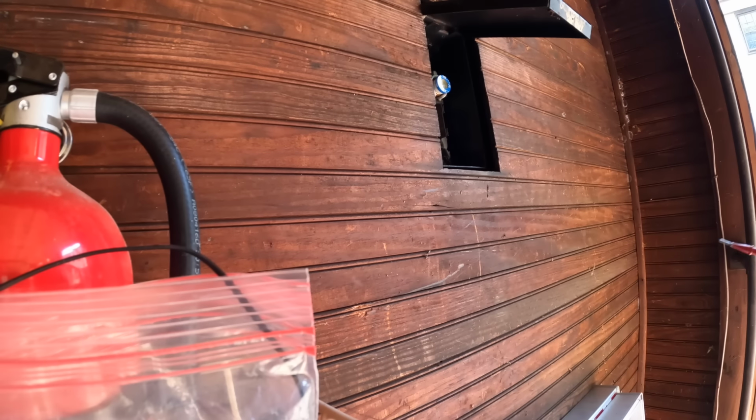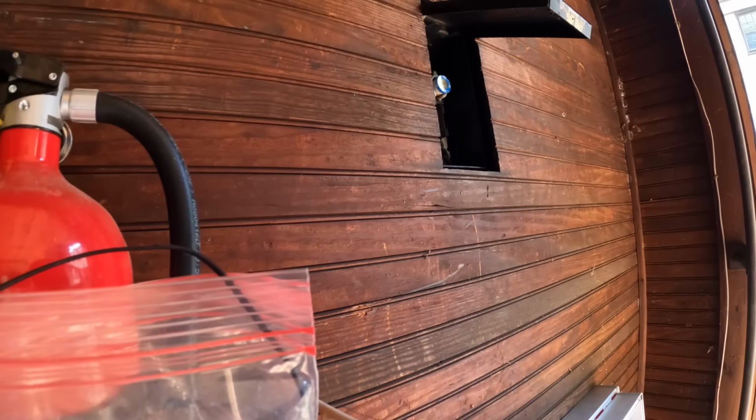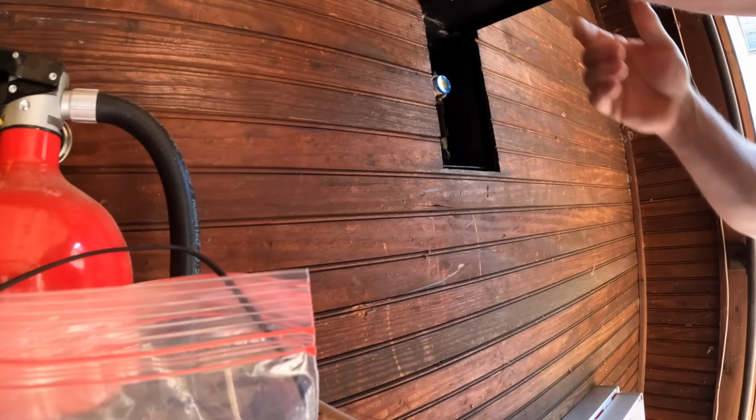So now I'm ready to move forward with the rest of the wiring project, which begins with coming out of this fuse disconnect here into a junction box right above it where the GFCI receptacle will provide GFCI protection for everything inside this garage.